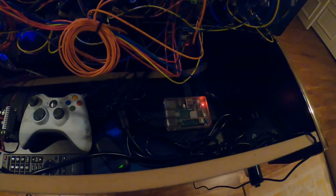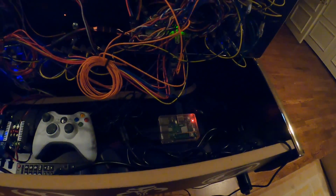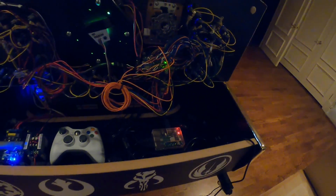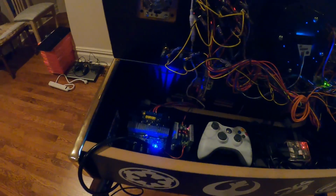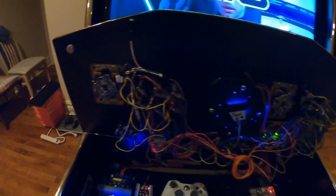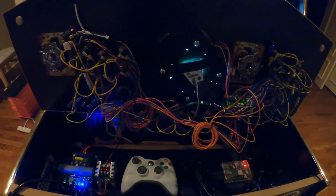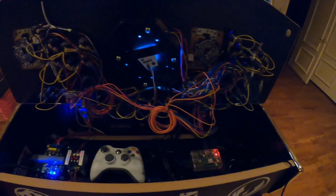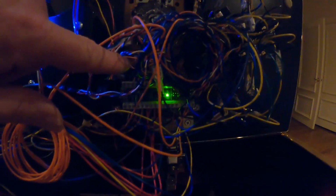And I said I had to really work hard to get the 2 light guns working. That was an incredible amount of trial and error on the programming using AdvMAME 1.4, but I ended up figuring it out, and I got them both working, and they worked really well. The wiring is a little sloppy only because I have a lot of excess, and I didn't want to cut the ends that were already tinned to go into the IPAC 2, which is buried back here.